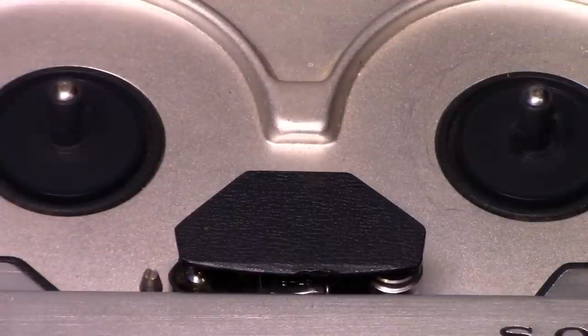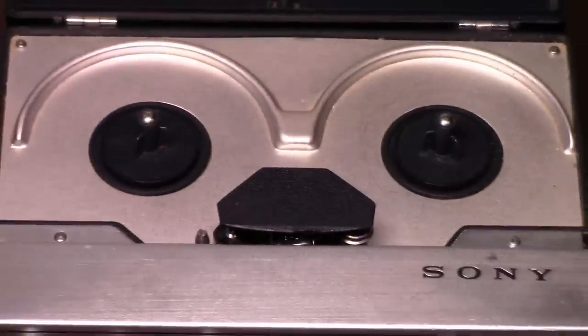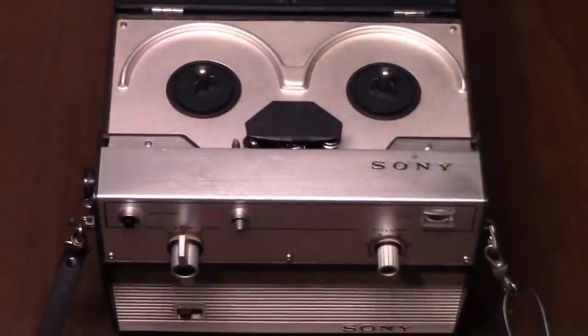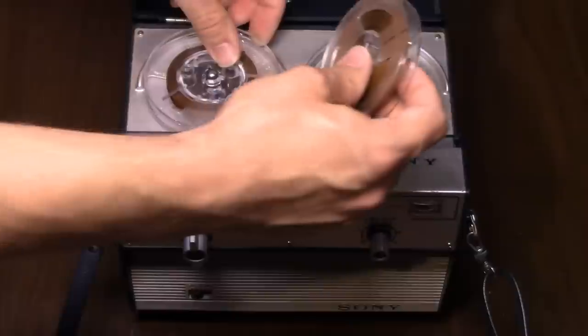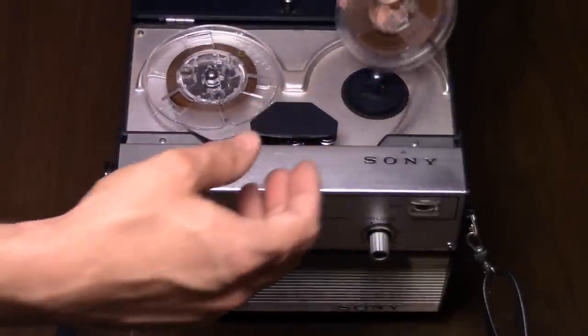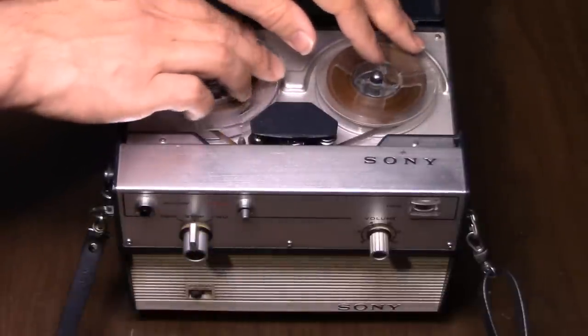That is due to an all-gear-based design in the drive mechanisms of this tape recorder. Whereas most tape recorders use either drive belts or rubber idler wheels, this recorder and its brother, the TC-905A, both incorporate an all-gear-based drive system, where the gears themselves, aside from rotating, maintain their positions and do not shift like idlers do. Because of that, they have to rely on clutches for whenever they change the direction for rewind or play.